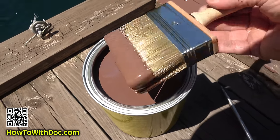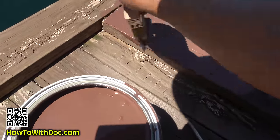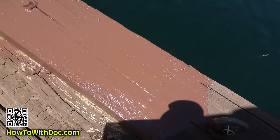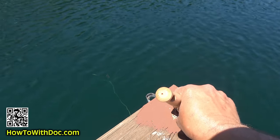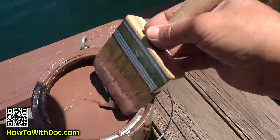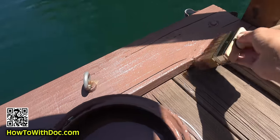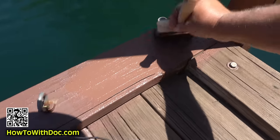You can see that this product is really thick — it's like a paste. What you want to do is apply it on pretty thick, a nice thick coat, and it will actually fill those cracks. I'm putting it on thick and you don't want to wipe it too much. The best way I've found to apply it with a brush is to take a small area, do normal strokes back and forth, get a coating, and then immediately come back and go in a cross pattern, almost like a grout.